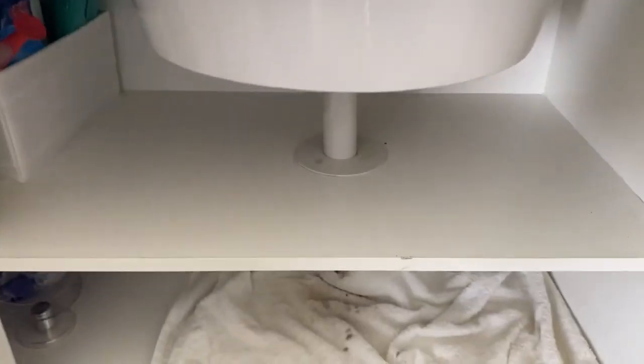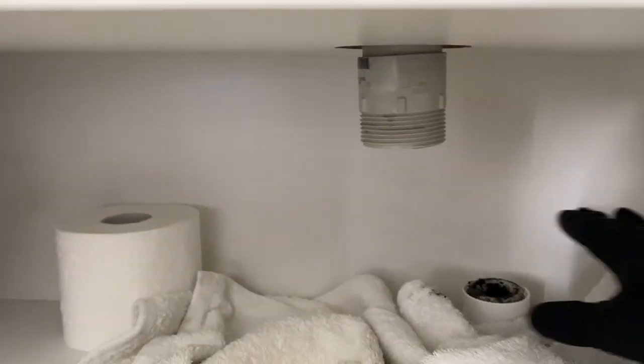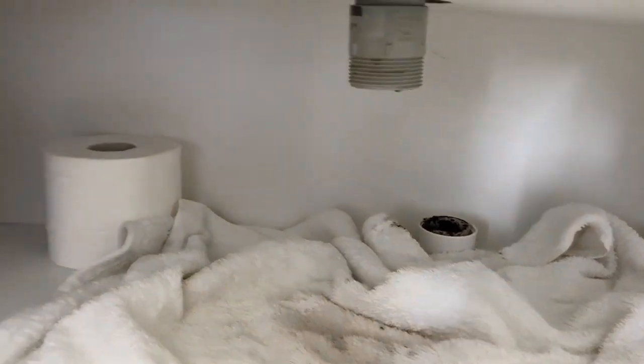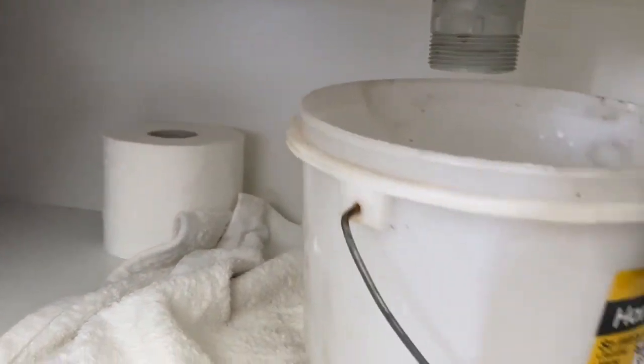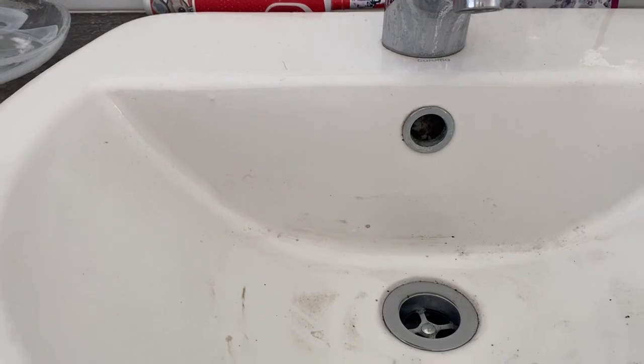As you can see, the basin is still holding the water yet there's nothing attached underneath — so all there is is that little bit of pipe running from the basin to the trap. So the blockage has to be in this waste pipe section that I'm unscrewing now.